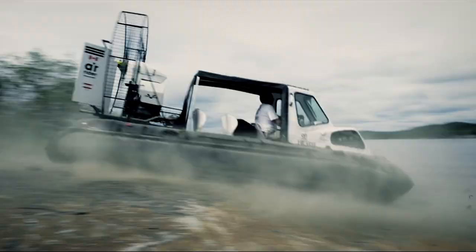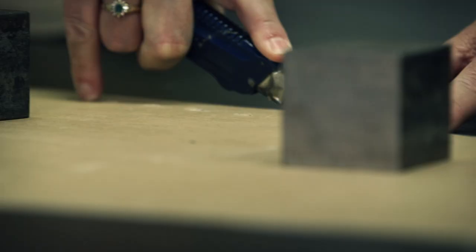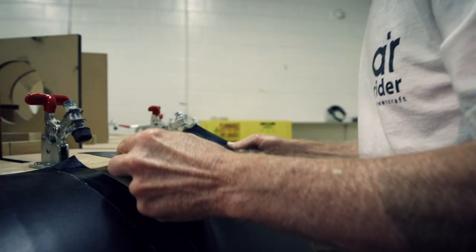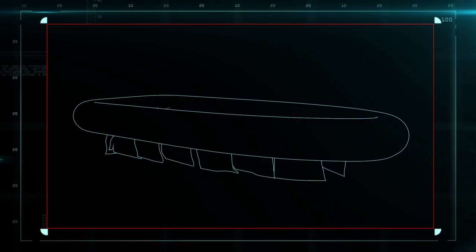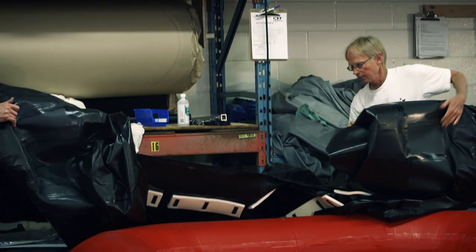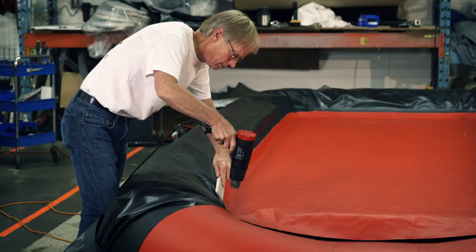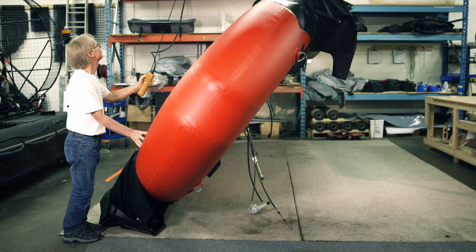To make the skirt, heavy-gauge PVC is rolled out onto a table. Using a grease pencil, the pattern is traced and cut — every piece made to measure. Heat-activated glue is brushed onto the strips, which are stretched over a skirt-shaped wooden template. Once all the panels have been joined together, the horseshoe-shaped skirt is ready to attach to the hull. The underside is brushed with adhesive, the completed skirt is pressed onto the hull, then hoisted and flipped — the skirt is wrapped around the hull and heat-sealed tight.